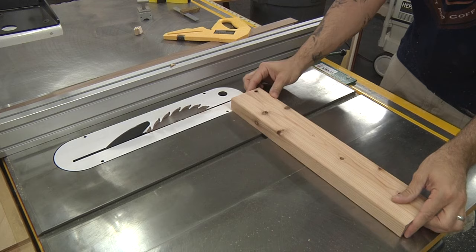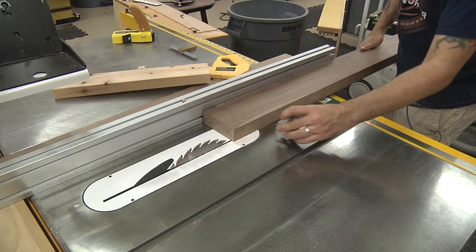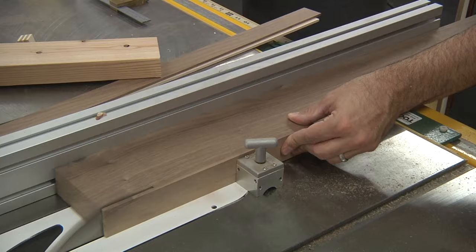The third method is my favorite and it involves using a piece of wood or a magnet as a stop to the left of the blade. I use a mark on the work piece to line up the blade for the appropriate sized off cut, then drop my stop in place and secure it. The first cut is a no-brainer since it's already set up. Subsequent cuts are made by placing the work piece against the stop while carefully nudging the fence into position. Just be careful not to bump your stop out of the way. This is my favorite method because it's easy to set up and there are no limits on the size of the stock or the size of the strips.